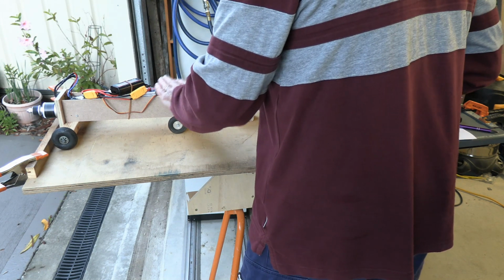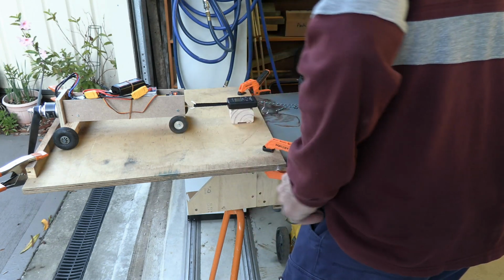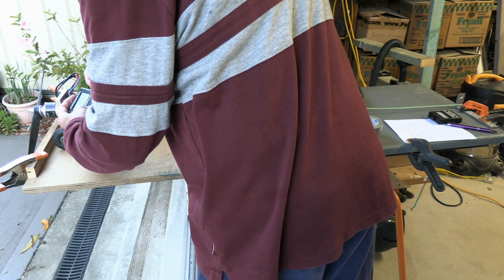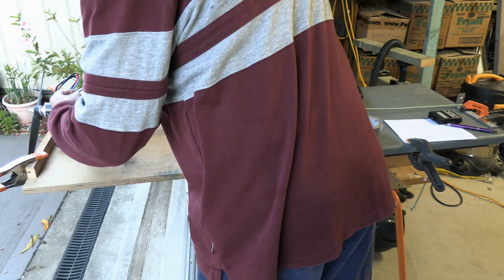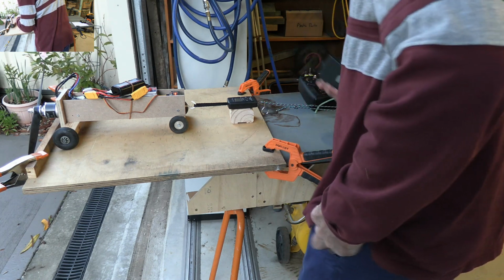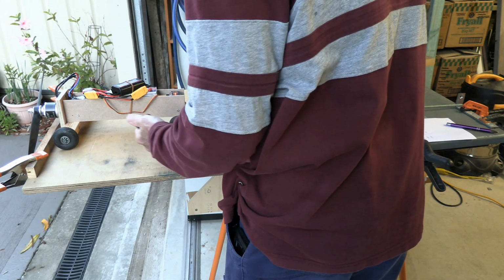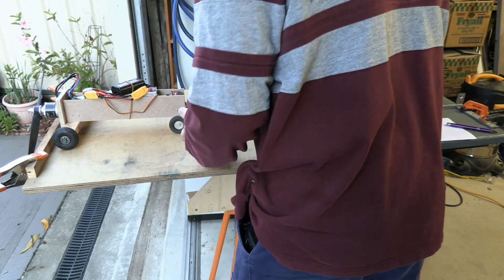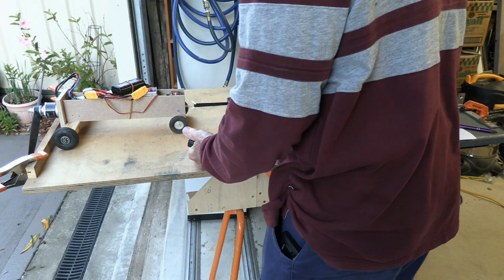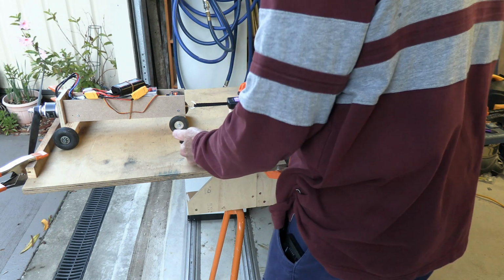Back at me. Okay, so we double check our battery. We'll have enough at least for one test here after a period of time. We've got our tachometer. We are going to record the RPM, the amperage, and the force of the thrust. Okay, so we make sure that that's zeroed out, and we are all set to go.